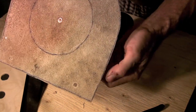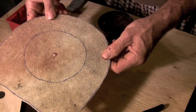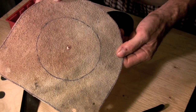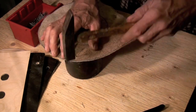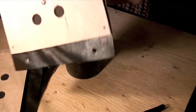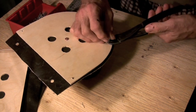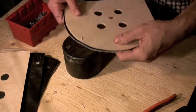The last thing you need to do when assembling the valve is to place a few rivets around the outside edge of the plywood to make sure that the leather always lays flat and doesn't fold over on itself. All you need is about four or five rivets around the outside edge. I'm just using common nails as rivets. The head of the nail is on the leather side and I'll drive it through the wood, cut them to length, and then just roughly clench them over. They just need to hold the leather in place — there really isn't a lot of stress on this rivet.